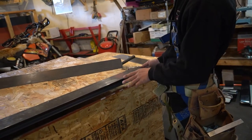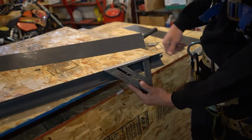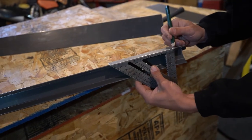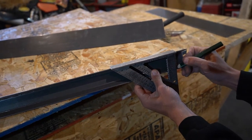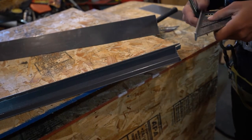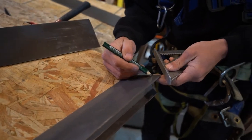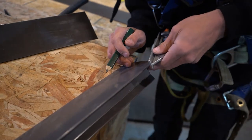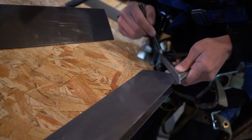In order to do that and make it look good, all we have to do is put our speed square on this face on our D style. We mark our D with a little notch here, and we also mark our kickout, because these are gonna be the two points that hit. That's all we do — just mark the point. Then from there you make an angle back. When you make this angle on the D style, you don't want the angle to go through the 90-degree face of the drip edge — you just want it to go about to that 90-degree face, just like so.